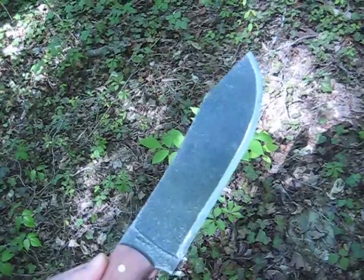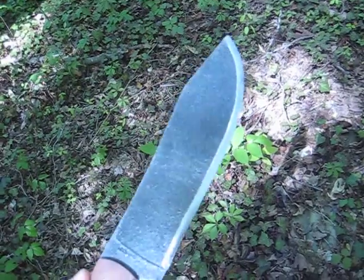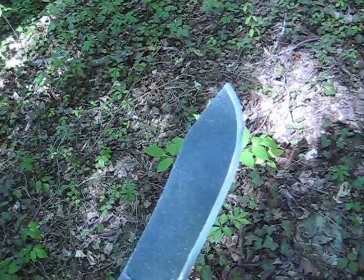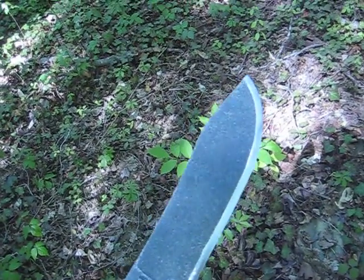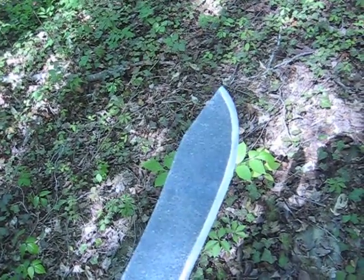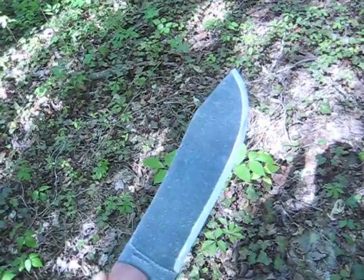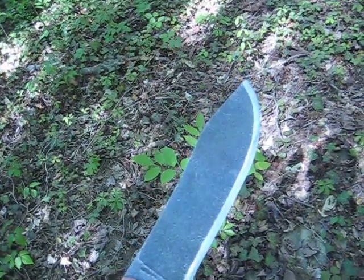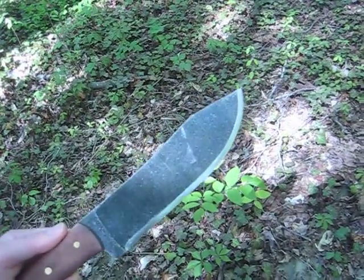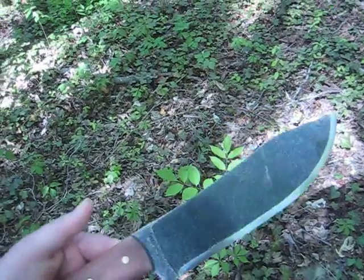A lot of people like convex grinds. I personally don't. I prefer a flat V grind at 20 degrees on all knives, whether it be kitchen cutlery, pocket knives, or bushcraft knives. That's just my preference, because that's the way I've always sharpened my knives — with a very fine angle that gives a nice cut. But this one is hair-shaving sharp. I sent a rant to ING Noob the other night and said carbon steel stinks. At first I tried with a file to change the edge geometry, then got out the belt sander and worked on it. He gave me some pointers about getting carbon steel sharp, because I've only really ever worked with stainless. Carbon steel is a new steel for me. I've worked with 1095 before on my Ontario US Air Force pilot knife, but I was not a big fan.